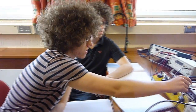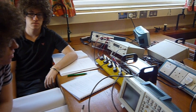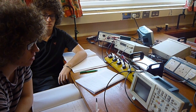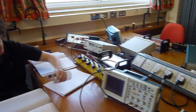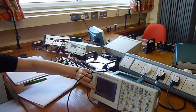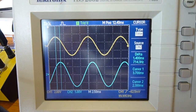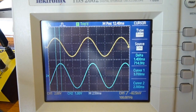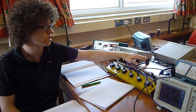We are investigating the effect of an alternating current on an inductor, which is this big coil here, which produces a magnetic field. You get some interesting properties combined with alternating current, and we're measuring the voltage here. This is an oscilloscope, and the lines on the graph represent the voltage of the circuit. It forms a sine curve because of the alternating current and the inductor.